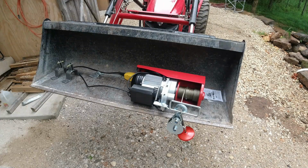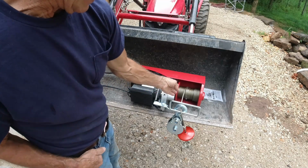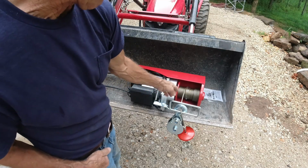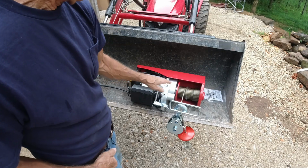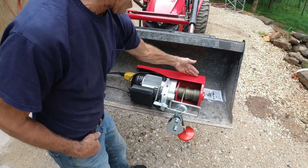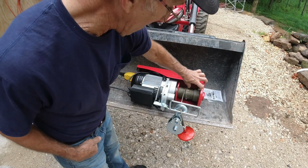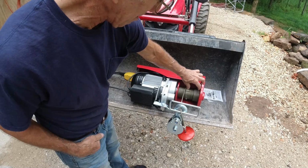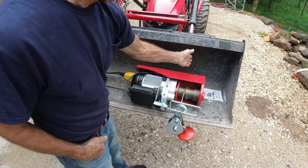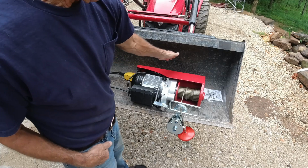Let's start out with a quick lesson in physics. With this hoisting equipment, we want to be able to keep the cable spooling as nicely and as neatly as possible. Now, if this were just mounted at one point in the middle, as you'd put a load on it, this end would be brought down and all of your cable would end up in a big coil over here, probably a big mess, and damage the coil. So this really needs to be mounted at 2 points here and there in order to keep it level.